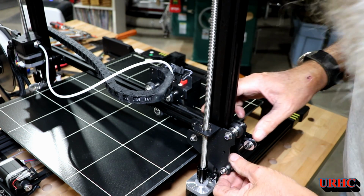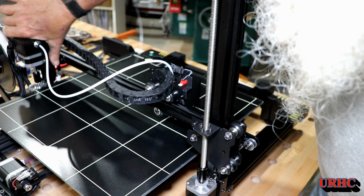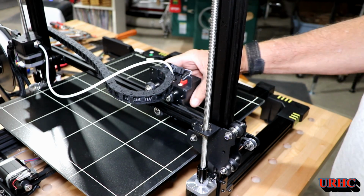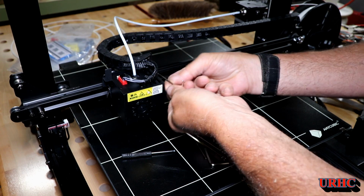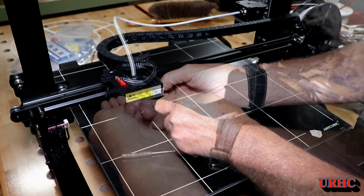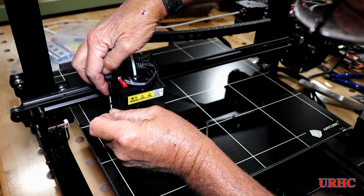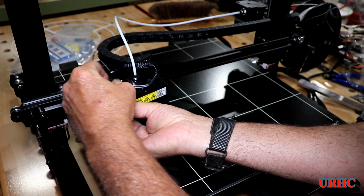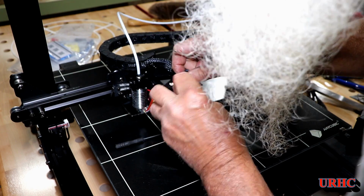It turned out there was some play in the extruder there. The wheel was loose, and it was a little bit down in the bed too. So I decided to just tighten this up, and it was good and tight when I started out. And I figure it had been running for 3, 4, 5 hours. I figured these things usually take a while to break in. I know my CR10 I had to adjust it after about 20 hours.